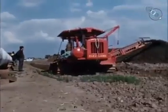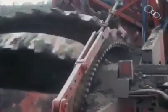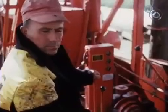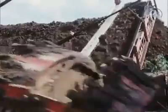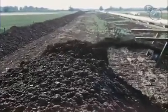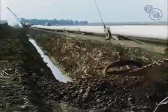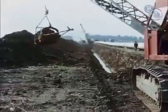The sections are joined together now into one great snake, and they're preparing the bed for it to lie in. This bucket wheel trencher can, in suitable soil, dig a clean ditch at the rate of about a mile a day. The ditch here is nine feet deep, as the indicator wires at the back of the machine show — as deep as the farmer wants it to be. The trencher makes easy work of ditch digging, but it is kept close to the pipeline team because this fen subsoil will not stand up for very long; the safest trench is the one just cut. There are occasions when the trencher cannot be used, and then it's back to the drag line — less elegant but tougher in a bad patch.